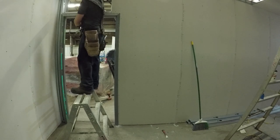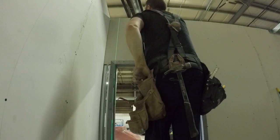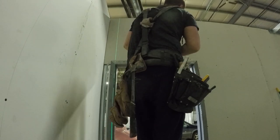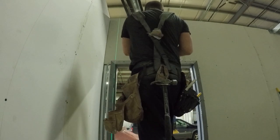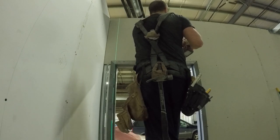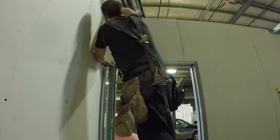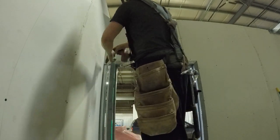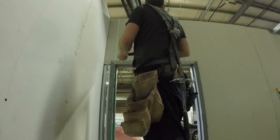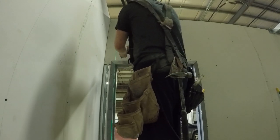You measure right to the top, to the bottom of the casing, because you want it to go straight in. The little leg piece needs to be able to jump up — there's a tab on the corner there that will not allow that drywall to go down. It has to be straight across at the bottom of the casing, because there's an actual piece preventing it from going in and down any further. I built these frames and I know the thickness is good. Normally you'll get them 5 and 3 quarters wide, but because I built these they're adjustable width — I built them to 5 and 7 eighths finish instead of 5 and 3 quarters, giving that extra bit which is exactly what you need. It's tight all the way around and it's perfectly fire rated. So if you're having issues getting the board in, 45 the back sides on both sides of the door.